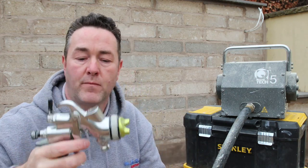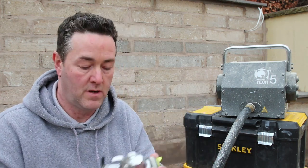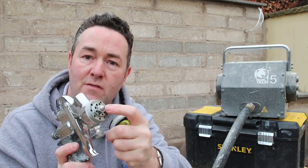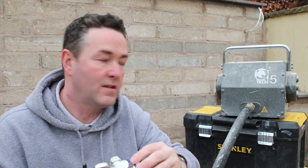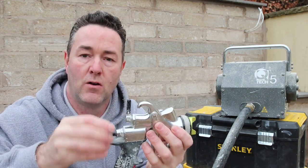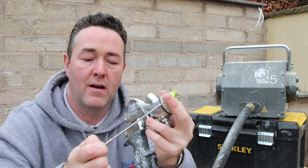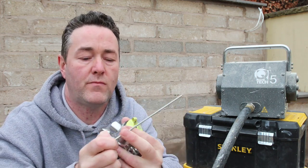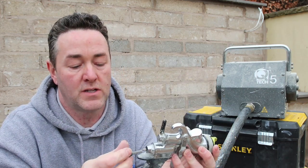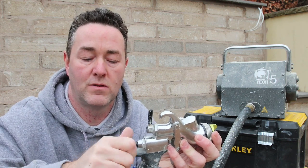The 1.5mm will do thinner paint. As I do with airless, I like to put some Vaseline around the threads. In your cleaning kit for the HVLP you'll also get some needle oil - just put a couple of spots on the needle to help it be more lubricated as it glides in. It doesn't mix with the paint because you're not putting that much on and it's not coming into direct contact. Put Vaseline on the threads too so that if any paint gets stuck, it won't seize up.